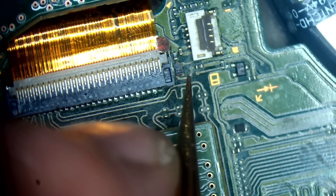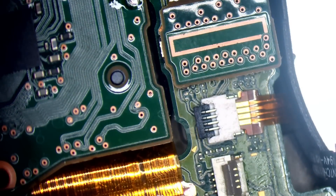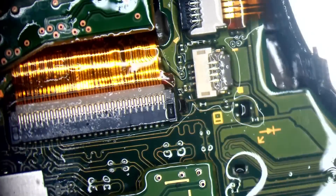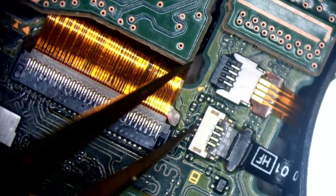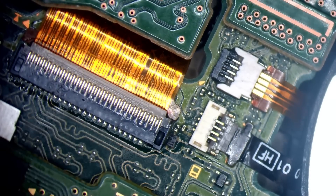There's a bit of flux around there but I can't see that causing it. Full fan — that shouldn't be doing that. It might actually just be down to flux in that connector. It could literally be down to flux in that connector. It shouldn't be doing that because the diode is there and the diode appears to work — if the diode appears to work then it shouldn't be doing it at all. I'm just seeing if it's a contact issue on the connector itself. Unless my fan's damaged — let me try another fan.